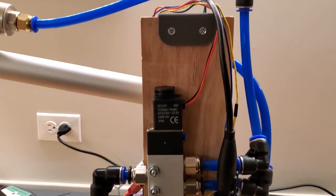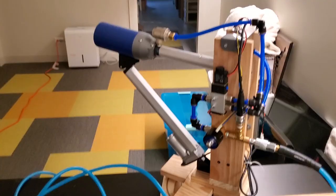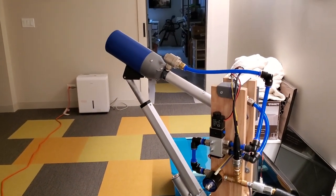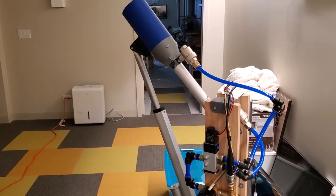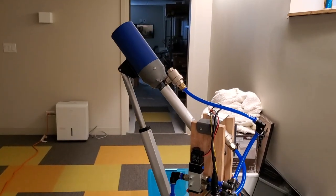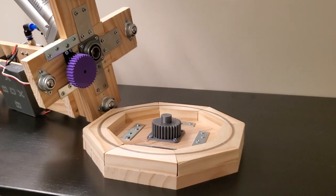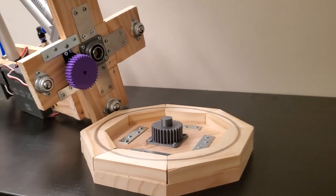In the back, I have the solenoids used to control the pneumatic cylinder, along with the electronics used to manage the remainder of the turret. To control the pitch, I have a linear actuator attached to the tip of the pneumatic cylinder. As it extends and retracts, it can freely rotate up and down due to the bearings hooked up to the tail end of the cylinder. To account for targets that are not just above or below the barrel, I need to introduce yaw control, which I did with a servo driving a gear around the stand's central shaft, while ball bearings manage the weight of the turret.